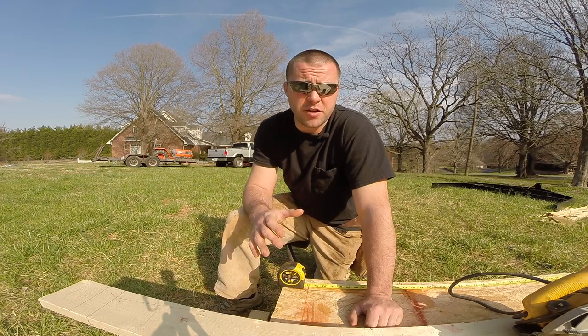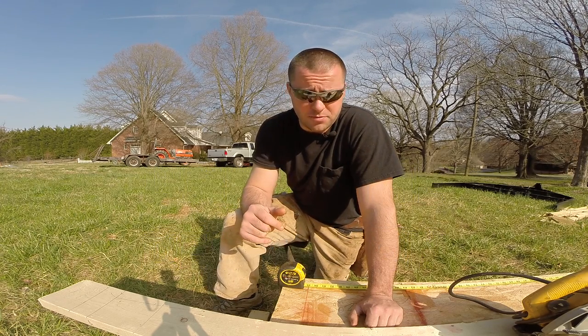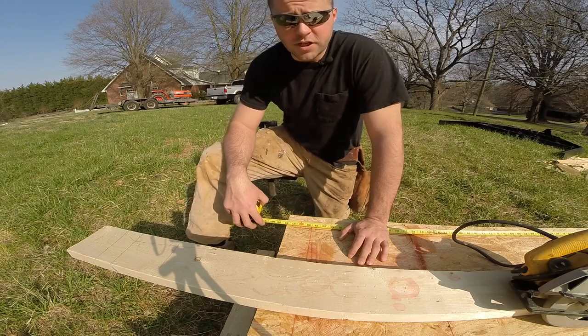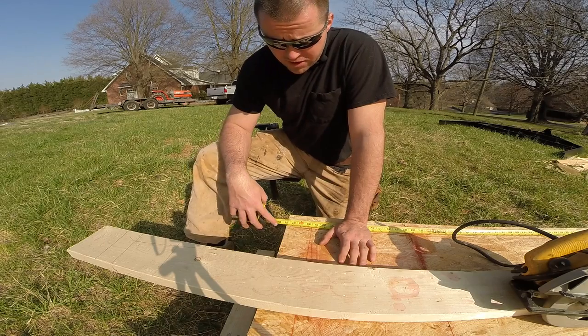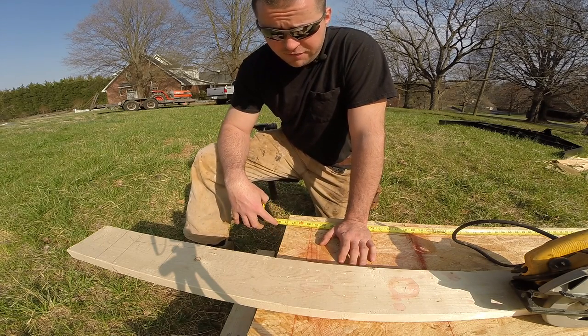If you're going to be doing a conventional A-frame style roof, there's a description in the link below where I figure those types of rafters. This video is going to show how I figured a one-pitch shed roof. So the first thing I need to do is figure out the total width of my trailer. My total width is 8 foot 2. Since I'm going to be going plywood to plywood when I figure this number, I need to add a half inch for each side of this trailer, so I'm going to end up with 8 foot 3.